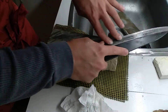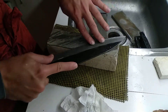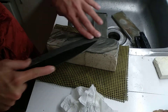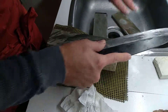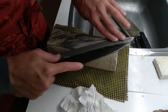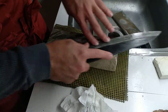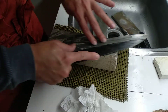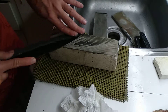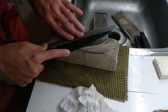One thing to notice is that this slurry feels like it's breaking down and becoming finer as you move, so if you want to keep grinding at a lower grade you have to refresh from time to time, otherwise it starts refining itself. That's what's happening here — and the sound, if you go back, you will see that it starts changing, because the slurry is becoming a lot finer. There is a bit of slurry that was still not broken down, and I found it by moving through the stone.